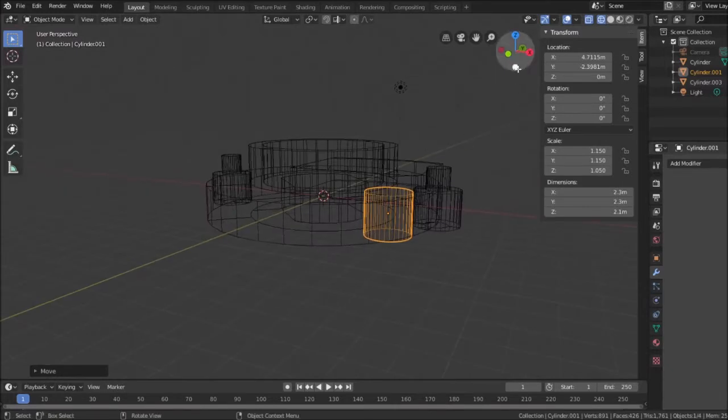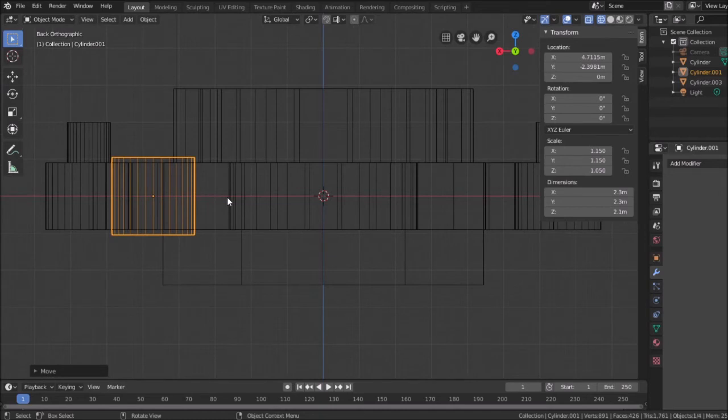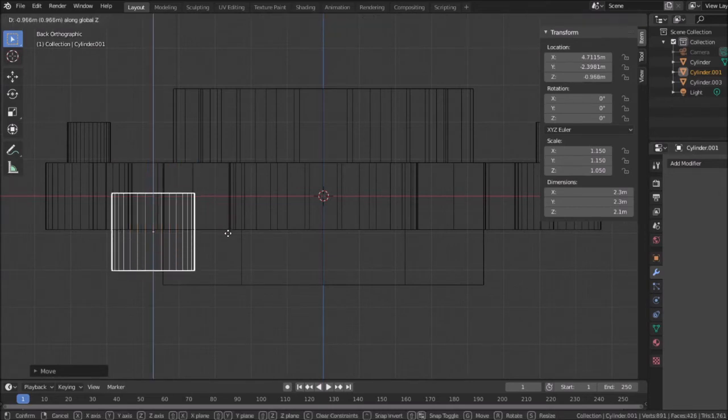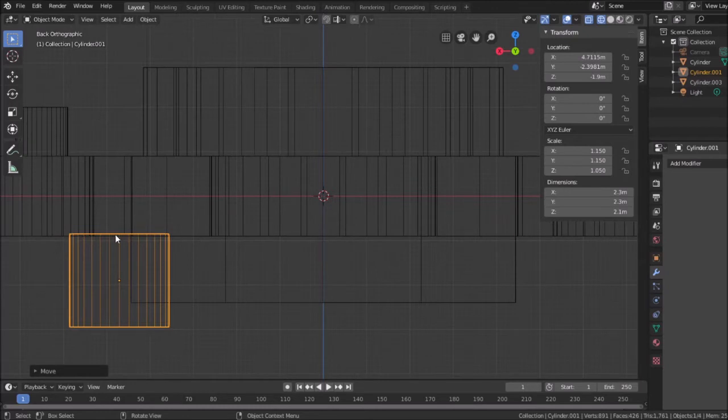So why'd I add that extra 0.1 millimeters? This is why. We go to this mode here. Zoom in a little bit. I'm gonna grab this and move it in the Z direction. And when we're moving it down, I think it went down. If it was 2 millimeters high, this is 0.9. Okay, so I only need to move it 1 point, and it's 1.9. All right. See, right in there, it gives it some meat to grab onto